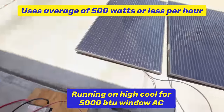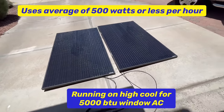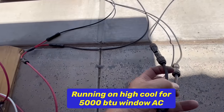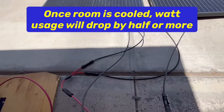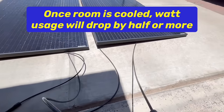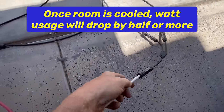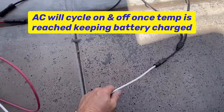And then we have two 330 watt mono solar panels wired in parallel. We have the negative from this solar panel and the negative from this solar panel paired together in this branch circuit, and it comes into just one outlet to go into the negative of our charge controller.